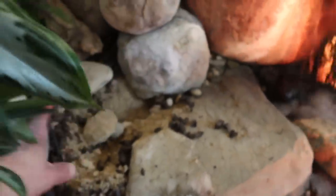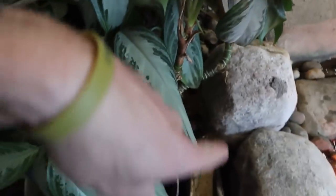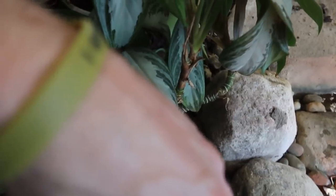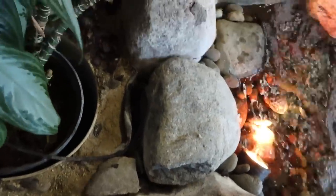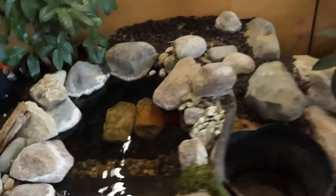We went ahead and fired up the waterfall. We came over and checked all of the edges along the back side — making sure the liner is high enough through all the pooling areas, all the way back, up, around, and down through. After poking around and looking at all the edges, we realized there were no weird folds in the liner and no water was getting out, so the next area of focus was the biofalls itself.